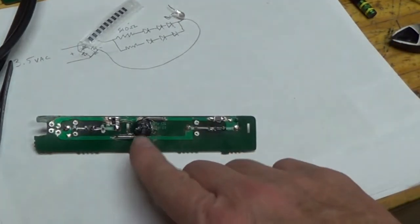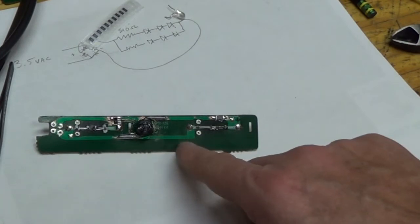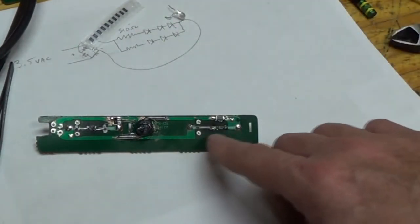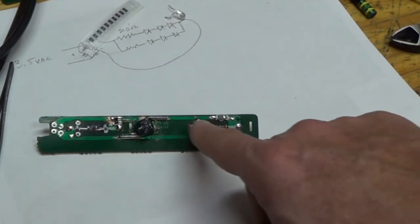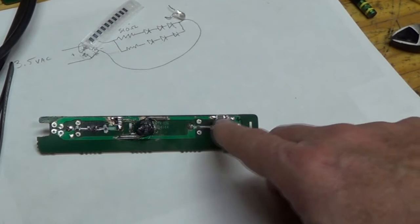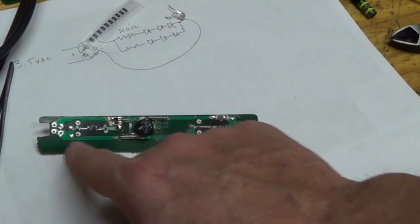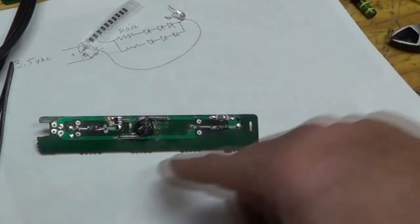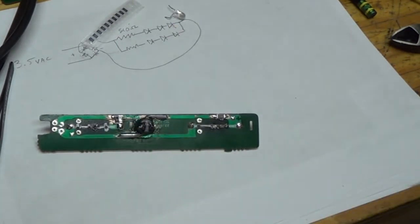Like I said, it's running through the rectifier, and we've got our negative rail and our positive rail. I cut the trace and soldered in these surface mount resistors, and then our plus and minus should come over to here, where we'll solder in the next board and attach our power to here.